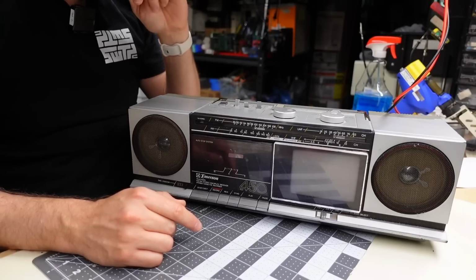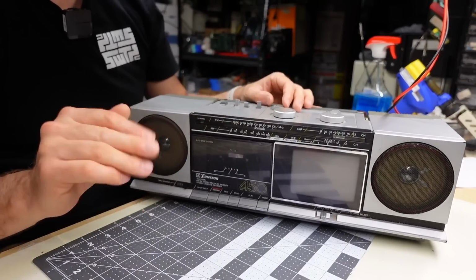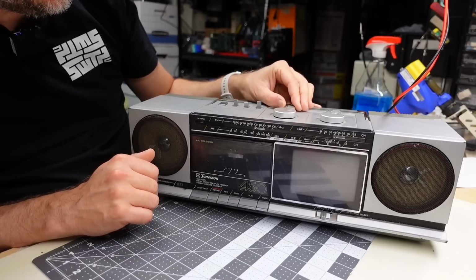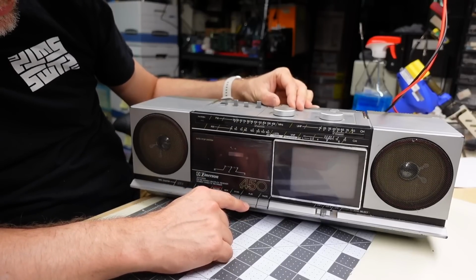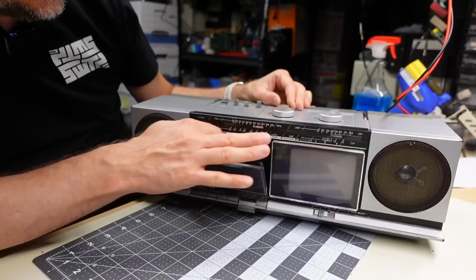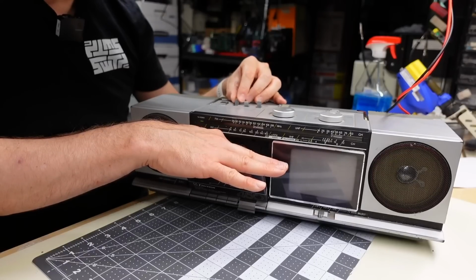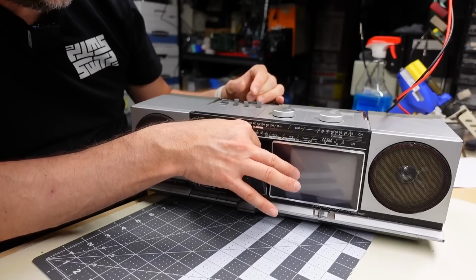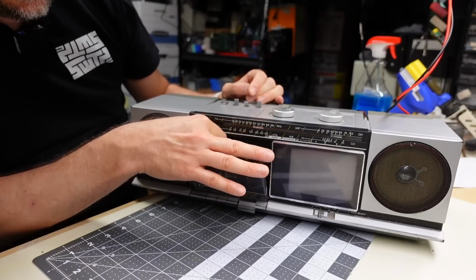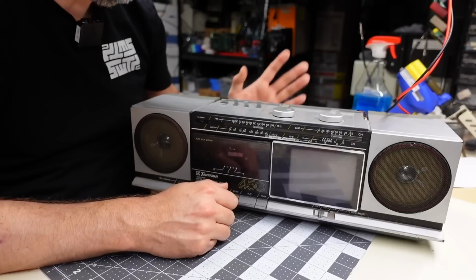Okay, so all right, FM's working. AM probably works, but down in the basement here, you really don't get anything. Let's see about tape again. Oh, you know what? A lot of that hiss went away. Interesting. All right, so with the tape, let's see if anything is even turning. Nope. Nothing. It's dead. Whether the motors are turning inside, I don't know, but the capstan's not turning, the take-up reel's not turning, nothing's turning. So that tape won't work until some more service happens to it.